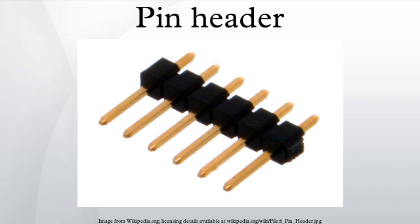Because of the way the connector attaches to the cable, in a two-row header, pins in one row have odd numbers and pins in the other row have even numbers. For multi-row pin headers, it's best to mark pin 1 with a square pad, then label pin 1 and the maximum pin number in the silkscreen.